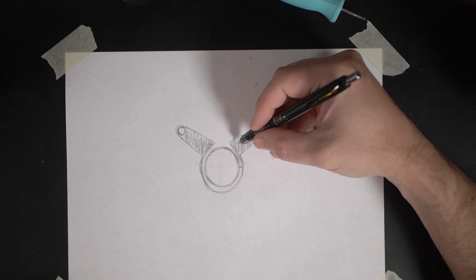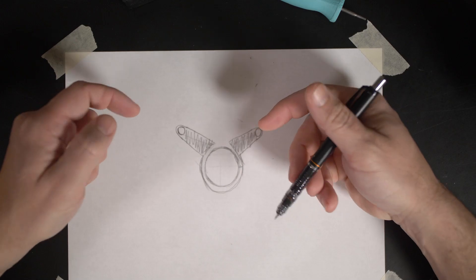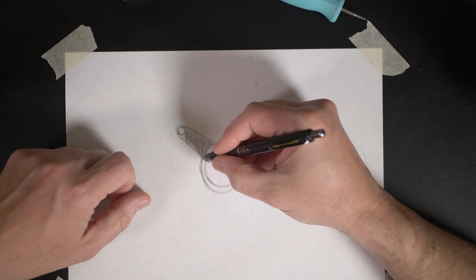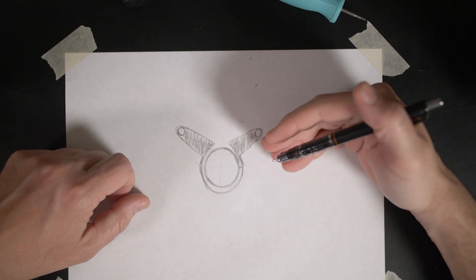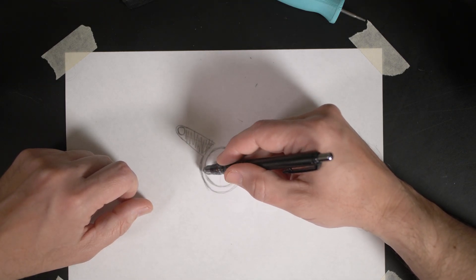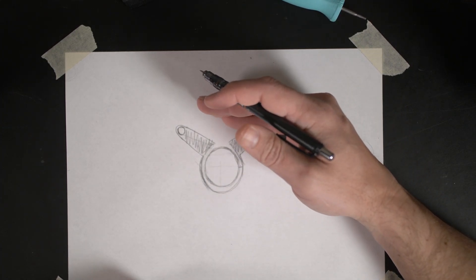What actually happens is you just need more force to pass the arms. When trying to get the broom handle out, the arms have to compress further because they're effectively longer. Even though you have to push harder to get the broom handle in and out, because the hammock is also longer, the holding force is lessened — so your broom is more likely to slip out, yet it's harder to remove intentionally. There really is an optimal length of arm in combination with hammock length, and the fork spacing has an interplay with arm length too.